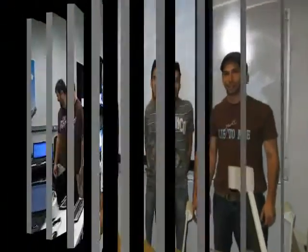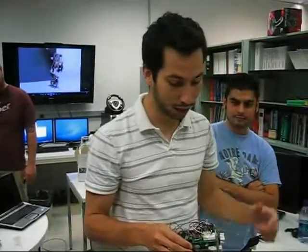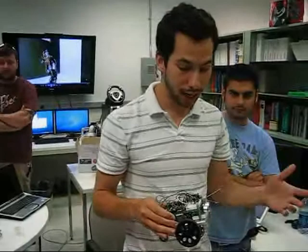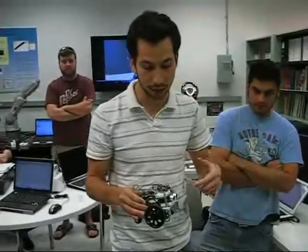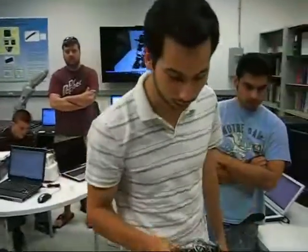So basically this program is going to do defensive driving. What it's going to do is check the whisker. If it detects something with the sonar right in front of it, it will turn 90 degrees and keep going. If it doesn't detect anything, it will turn a little bit to the right or left, depending on which whisker it touches.